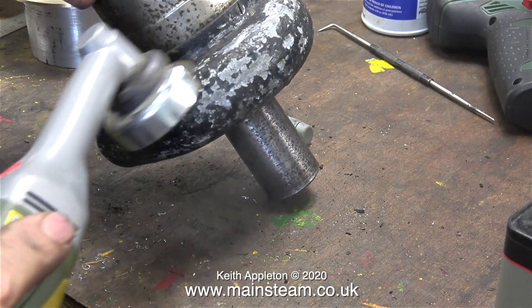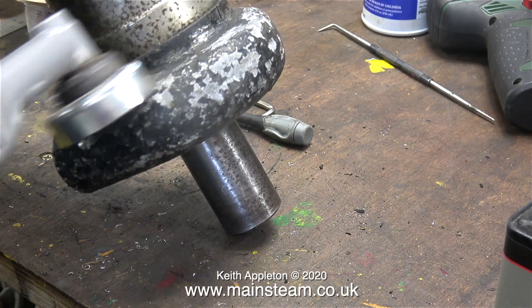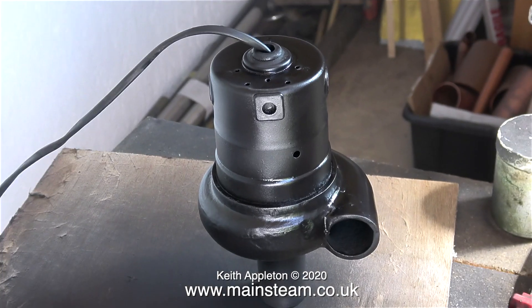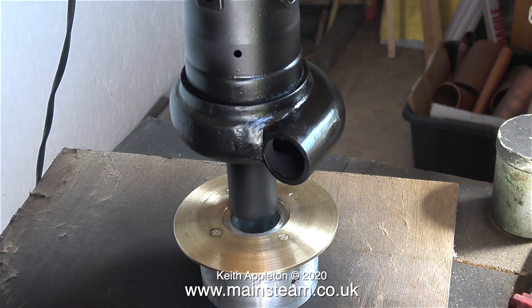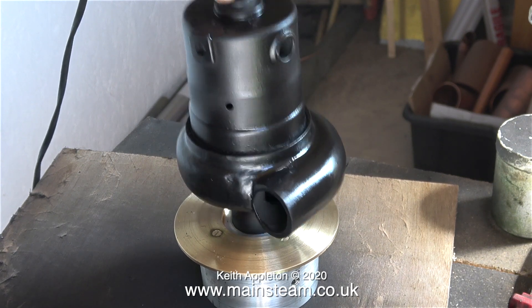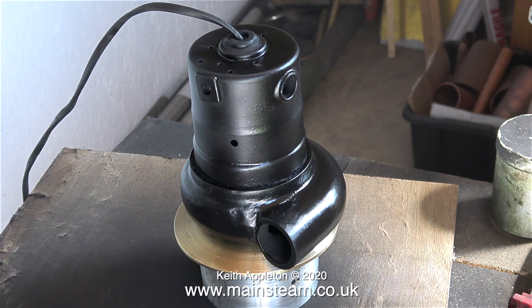I can't just screw this horrible old blower into the top of my new part, so with my Proxxon angle grinder — fitted with a flapper wheel, not a cutting disc — I'm removing all the old paint, or most of it anyway. Now it's into the outer part of the workshop to paint it with heat-resistant paint. Before it had even dried I fitted it into my adapter, just so the final clip would be a shot of the paint drying on a nice base. And that's it for this feature about making a blower extension — stay safe, stay well, thanks for watching, and I hope you found it useful.